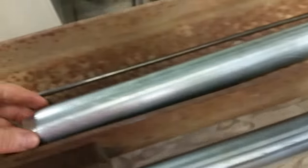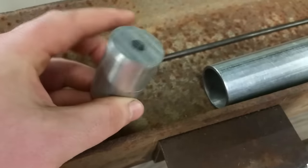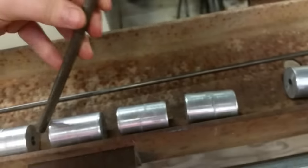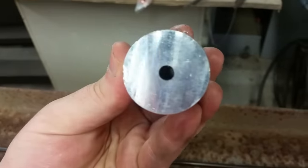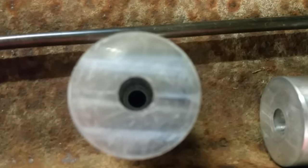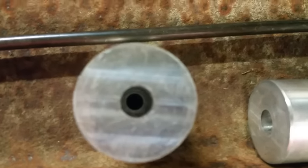In this case, I'm going to be rifling these really thin tubes, so obviously they're not going to be able to support themselves. Inside this galvanized pipe are some more bushings, but these don't have any springs between them — it's just all solid. You take one of these tubes and on one end, see how that sits in there nice and clean? There's a smaller quarter-inch hole for that pushrod to go through, so it's holding that tube by the rim of that blind hole there.